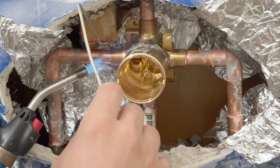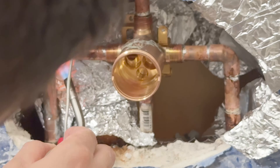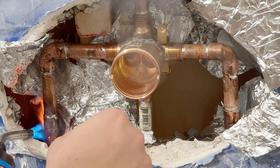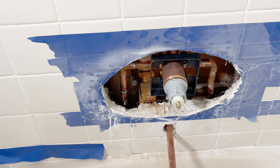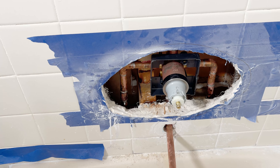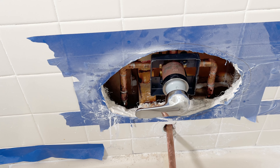Time to solder. Just take one fitting at a time, don't rush it, and let the heat do the work. It is time now to test for leaks. Replace the plastic holder into the valve, the cartridge goes second, and then the retaining nut. Make sure the retaining nut is on tight. This is sufficient for you to turn the water main on. After the main is on, use the handle to turn the water on, letting it flow, and checking for leaks.